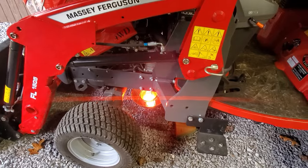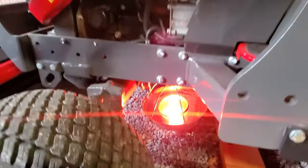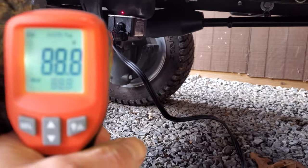Okay, so yeah, this really started about a month ago. It was about 53 degrees Fahrenheit outside, and it was actually cooling off. So I did it a little later in the day as it was starting to chill, and I tested the heat lamp at 30 minutes and 1 hour on, located directly under the oil pan. I'll show you that information here in a moment. And then today it's 37 degrees outside. It's actually very cold, about 27 or 26 Fahrenheit this morning, and sort of warming up a little bit. It's like 41, so pretty steady around the upper 30 range when I tested the magnetic block heater. And I did that for 30 minute, 1 hour, and 2 hour segments.